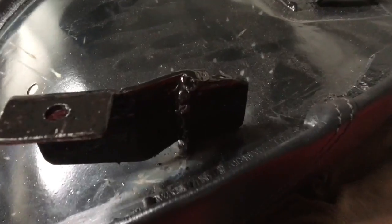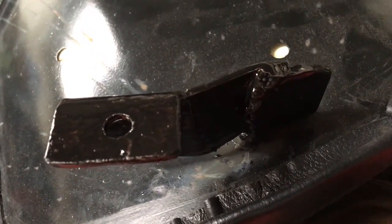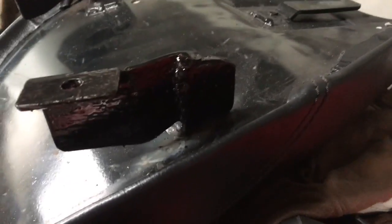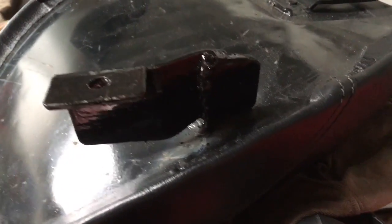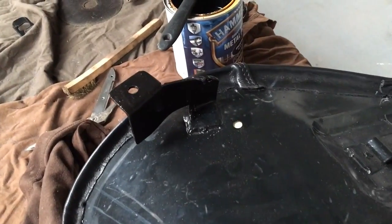When I manufactured my brackets, I hacked off the brackets that were there and welded on two new brackets. Just gave them a quick lick of paint — a lick of Hammerite. I was very worried about the heat, but I just put some wet rags around and didn't seem to get a problem at all. Just welded on easy.